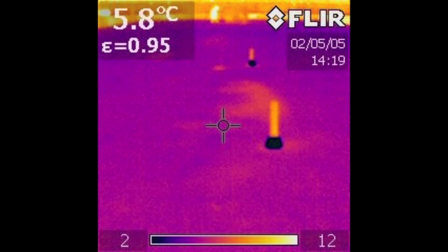Here is our last photo of an infrared scan of the roof. You can see between the two plumbing pipes there's a wet area that needs to be cut out and replaced. We fluorescent spray paint that area, and when daytime comes and it's time to repair or resurface the roof we cut out those wet insulation areas and put dry insulation in. As you can see with the infrared photos, infrared is an invaluable tool for a flat roofer to find roof leaks. It far surpasses any experience a roofer can have trying to find leaks with his feet or visually during the day. You come back at night, scan the roof — the water cannot hide from us. It's an excellent way of finding roof leaks for repairs or roof resurface projects.